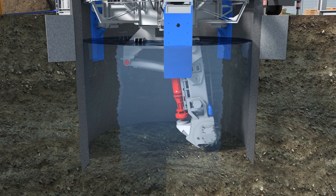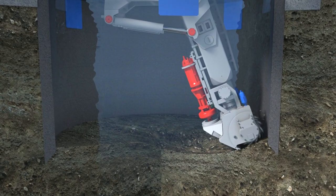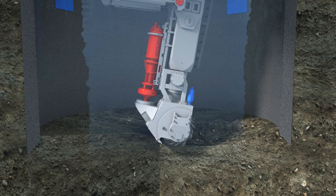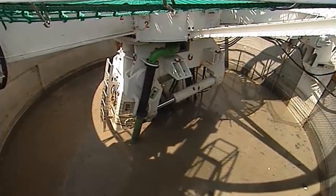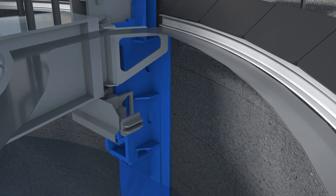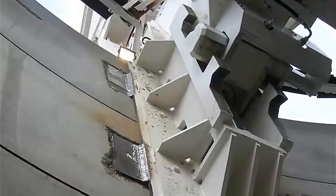The cutting arm moves radially from the center to the outside of the shaft. In soft soil, the cutting edge on the shaft is able to trim the excavation as it sinks into the ground. The cutting speed and the movement of the boom can be varied to achieve the best excavation rate. When it is necessary to excavate under the cutting edge, such as in hard soil, the machine can be moved to a lower position in the bracket to extend the reach of the boom.